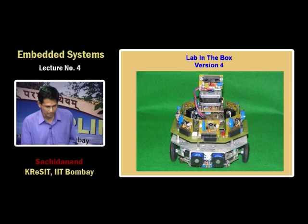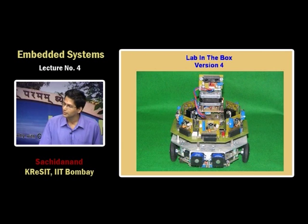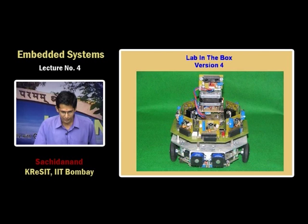We deployed 20 of these machines in our lab. The problem with this machine was that it was quite expensive — something like 7000 rupees. So we went back to the drawing table and redesigned the whole concept. We then designed a more universal machine which has a 360-degree sensor scan, reconfigurable 8 proximity sensors, an electromagnet for pick and place, and line sensors. But it was still not good enough for mass production.